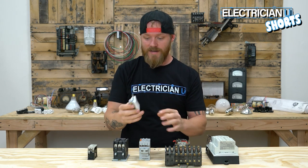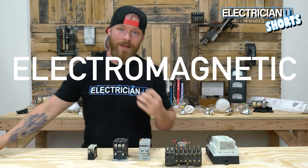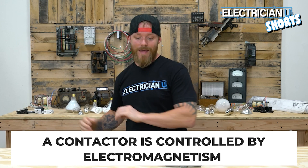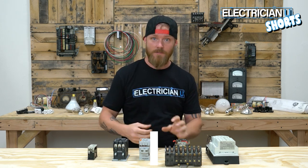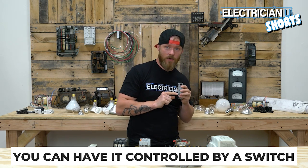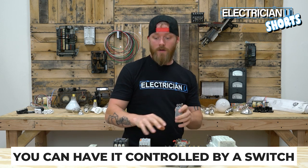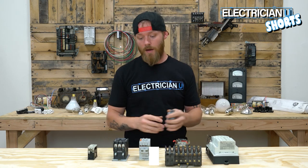The other cool thing about a contactor is you don't have to walk up and push a button. These are electromagnetic switches, meaning they are controlled by electromagnetism — by a signal, by current. You can have a switch sending current to the coil, which energizes it and changes the state of the contactor, allowing everything to turn on.